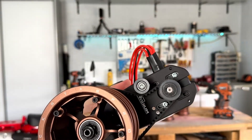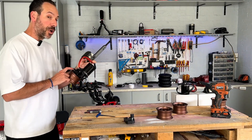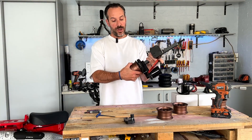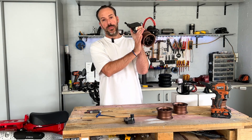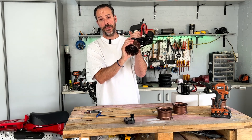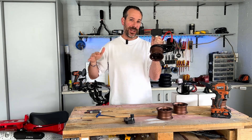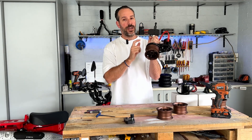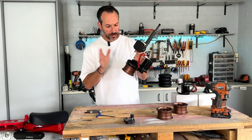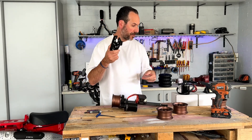This is going to be a sweet build — 173kV motors, 65T to 16T gearing. With the 65T pulley they're much smaller. I run the 78T rear end pulley normally and if you catch a gutter on the wrong angle it tends to clang — you won't have that issue with this because it's much smaller. We're using Radium motor mounts to hold everything together.